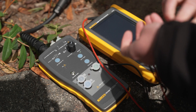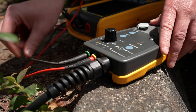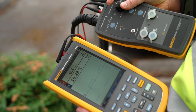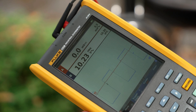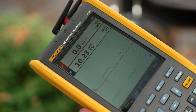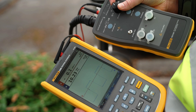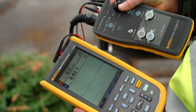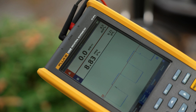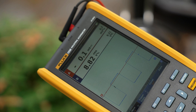For advanced testing, use a scope meter. Connect it to the CP signal output terminals of the charging adapter and turn the switch to position B. This simulates connecting an electric vehicle — the connector is now locked. A pulse width modulation signal appears on the scope meter. Check the charging modes and duty cycle. Then return the CP switch to position C. The signal can now be visualized at its frequency.